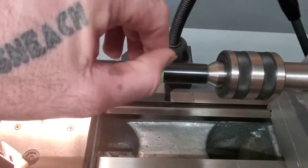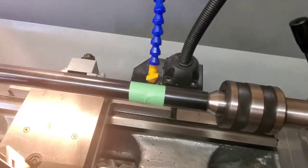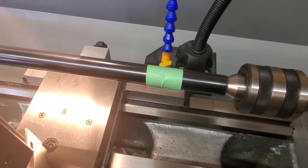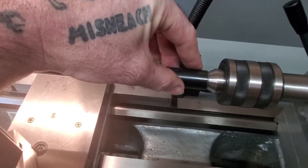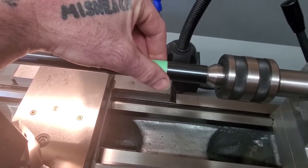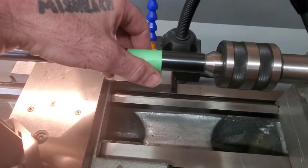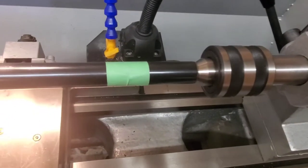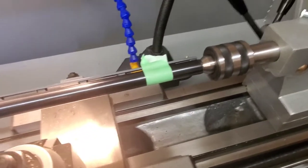And most people probably don't show how to do this online or on YouTube because most people use what's almost a reamer. It's like a forming tool, reams this out, and then they run an actual tap. That's how most people do it to make a barrel take chokes. But I'm going to do it on the lathe because if you do it right, it's not just as good. It's actually better. But I'll show you something real quick.